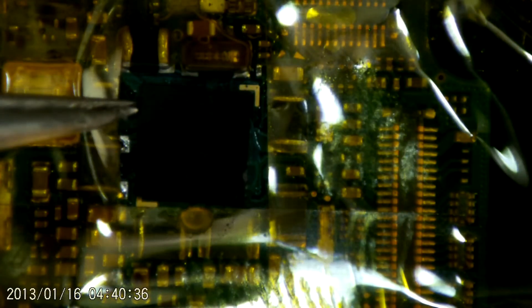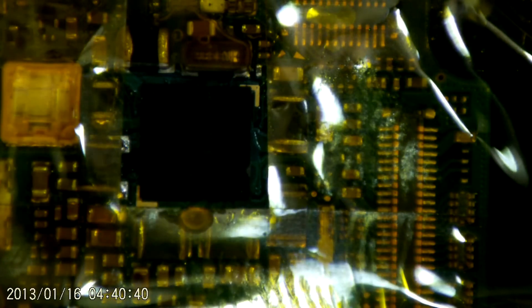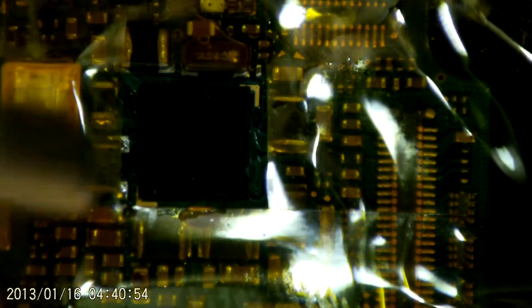I've cut a bit more footage. I've already dropped the chip and right now I've got it aligned with flux underneath just to keep it tacked down. This is still with solder balls already attached both to the board pads and on the chip. I thought I'd just do a quick method, but overall it's probably not worthwhile given the risk of creating bridges when reapplying it.